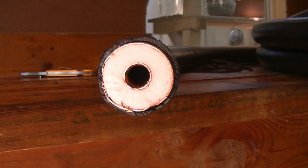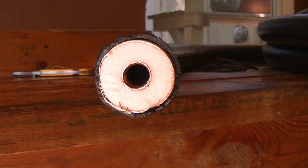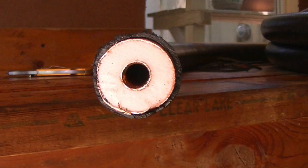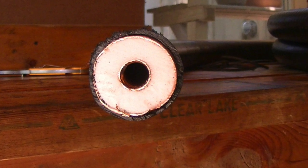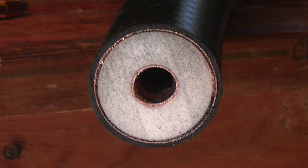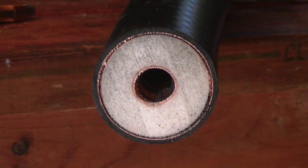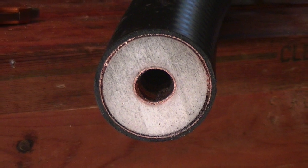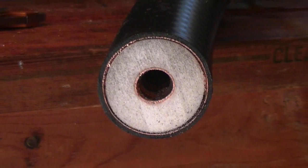Take a look at the end of the hardline. Take note of the damage done to the copper shield — this happens from pushing too hard upon the hacksaw. This was done as we cut it off the large spool to the proper size and length needed for this project. The next cut shows a smooth, light touch with the hacksaw and a clean, workable surface, so be sure to use a light touch with the saw.